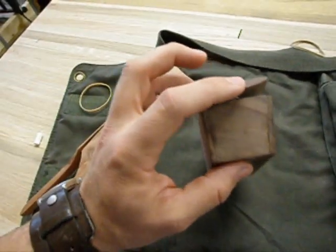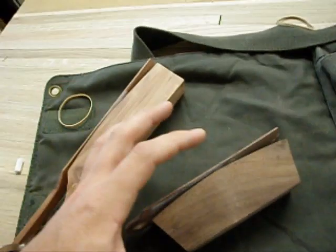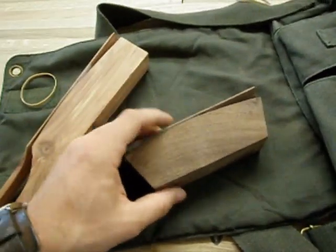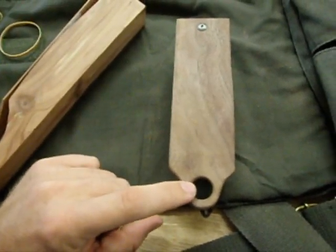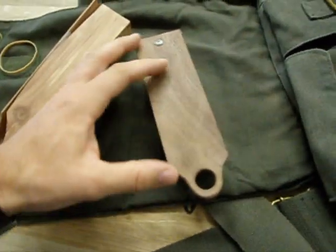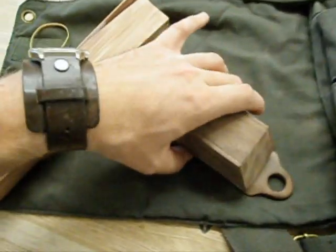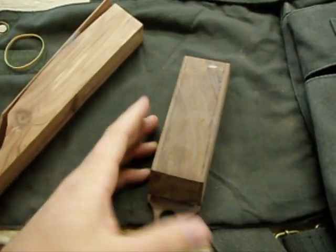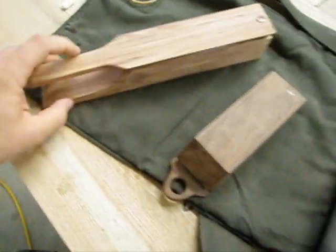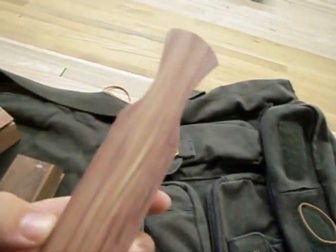The lid is a quarter inch - it's a little thinner on this one. I didn't get a good arch on it like my last one, but it still sounds pretty good. The thicker you go on the top, the better sound you're going to get when you put the arch in it - but don't make it like a two-by-four thickness. This hole is five and a half inch. I just kind of free-handed drawing this after I had it together. I usually make the box first, lay it down on the piece of wood for the lid, draw a line on both sides, use the table saw to rip it, have an extra length at the end, and then cut whatever shape I want out of it.